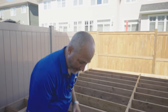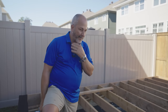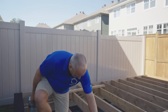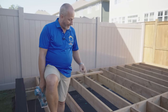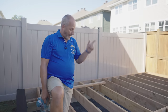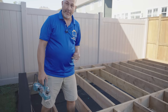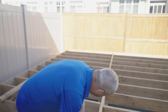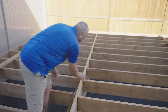When you're going to do the joist planing like this, if you're working as a team, remember not everybody frames the same. I know Matt likes to throw a nail from the top on an angle into the rim joist. So I gave him the marker — he's going to walk around, identify with a circle any nail head that needs to be sunk, and put an X on the top of any that have to be planed. So I know I've got two here, three here, maybe four.